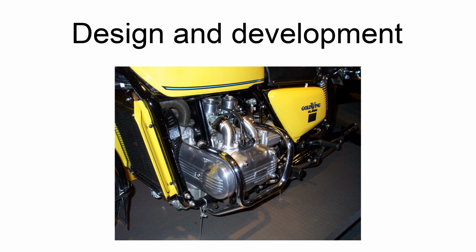Later models were made lighter and slower to fit FAR 103. The Goldwing UL model has a standard empty weight of 252 pounds (114 kilograms). It features a cantilever midwing, canard, a single-seat, open cockpit, tricycle landing gear and a single engine in pusher configuration. The aircraft is made from molded fiberglass epoxy composites, including Kevlar, carbon fiber reinforced polymer, and high-density foam.